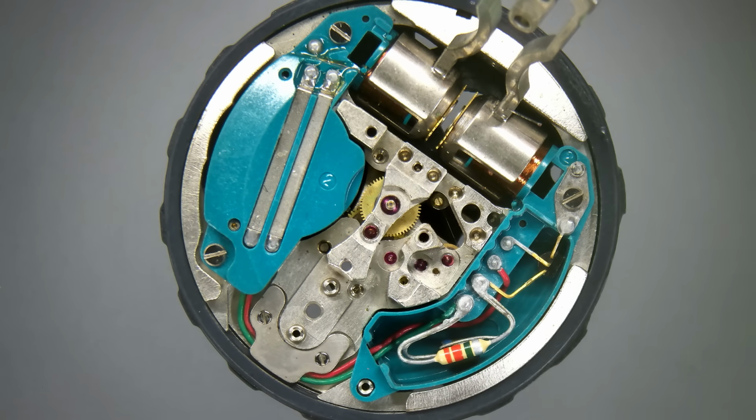So how does this bit come apart? It's almost wedged in as well. And I don't want to damage anything, do I? So, well, look, that is a stripped movement. We've got a lot of cleaning to do, and I've got to figure out how to get that off. It might come off after the first wash. I'm going to ultrasonic most of the parts first in a pre-wash, and then it's going in the cleaning machine. We'll assess the parts and then possibly clean them again.